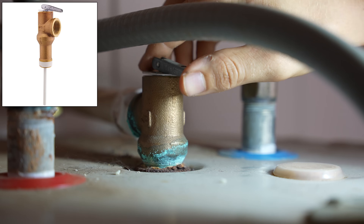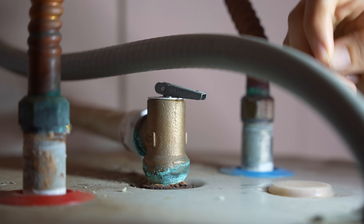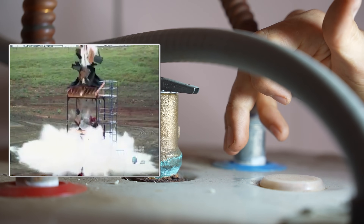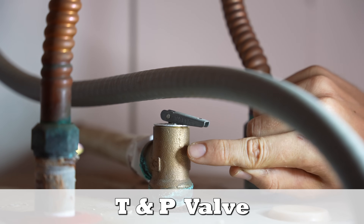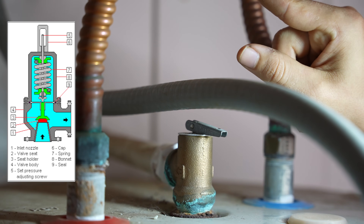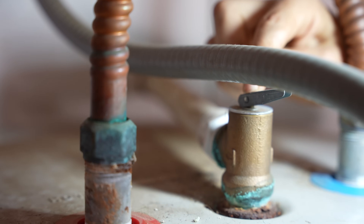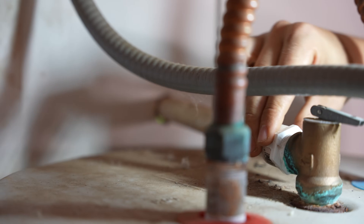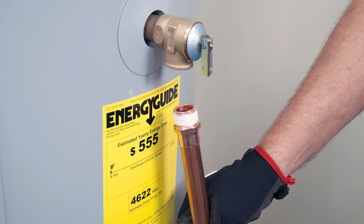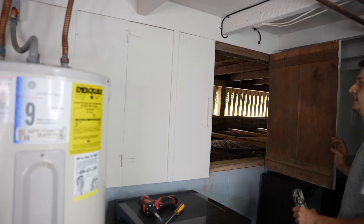This right here is the pressure relief valve. It's a safety device. If, for some reason, the water heater keeps heating the water and not stopping, eventually that water will start to boil and create steam. Once there's enough steam, this water heater will explode, which can cause it to go right out the roof. That is why we need a temperature pressure relief valve — it's spring-loaded, so if enough pressure builds up, it will pop open and allow the water and steam to come out through this pipe. In most cases it'll be a copper pipe going straight to the floor, about six inches away from the floor by code. In my case, this plastic PVC pipe actually goes outside and just right under the house.